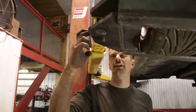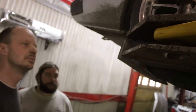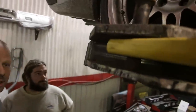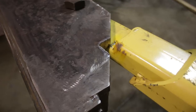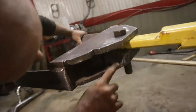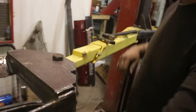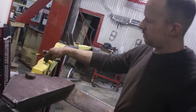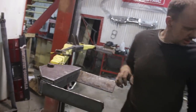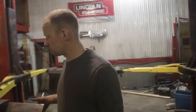I might get a little less deflection if I put spacers in between there. If I took up that slack — see how it's touching here? So I'll put some spacers underneath, I think we'll get rid of more deflection. The arm itself is not deflecting, it's the play in the receiver. Let's take up that space and we're golden. I had to notch a little corner in there, and we've welded in two plates just to take up that space — the back ones were an inch, the front ones were a half inch. Even though it doesn't take up everything, it's much better than it was. We'll always fight the play in here — maybe I'll make a little shim just to push on that.